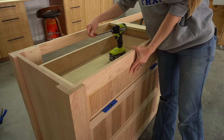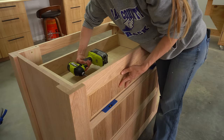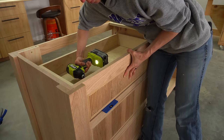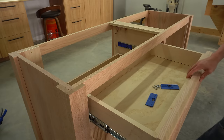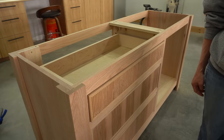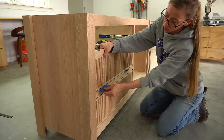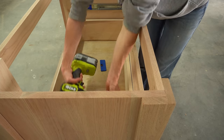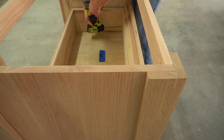After the glue was dry I secured the fronts in place using screws through the inside of the drawer boxes. The shims I used are the ones that come with the Kreg drawer front installation jig — handy, but any eighth inch shims would work fine. This was quite time consuming to get everything cut and fit together well, but it was well worth it.